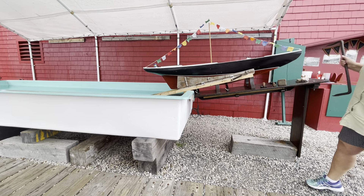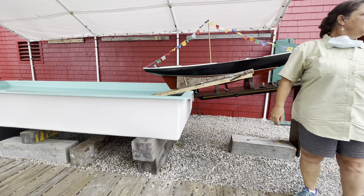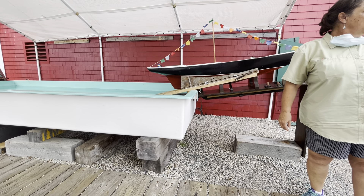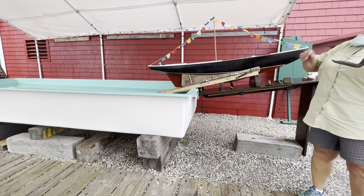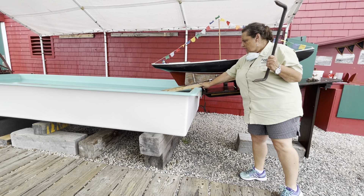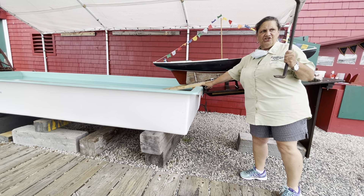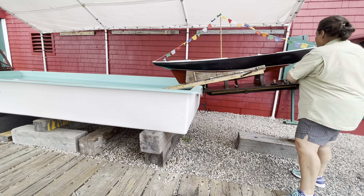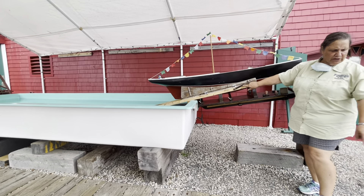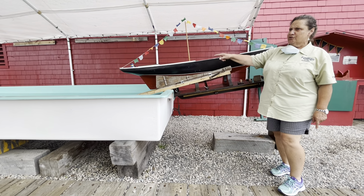We had two sets of brakes on this ship. The Bluenose II is 139 feet long, so we had one of these iron dogs, which was a brake — they actually attach the sliders to the ground ways so she wouldn't jump. We had many of these on each side. And then the other brake is a trip shore — we have a couple pairs of these really thick timbers. Once these are knocked down, we're going to hope she takes a trip from the shore right into the ocean.